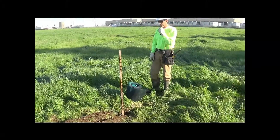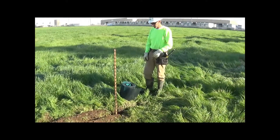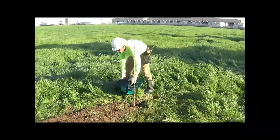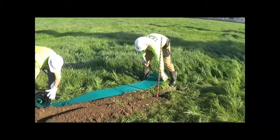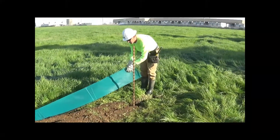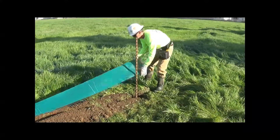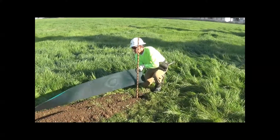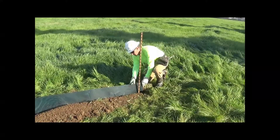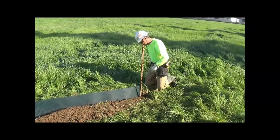For this part of the installation, we're going to install the sediment control barrier at the base of E-Fence. This is Urtec's sediment control barrier, called S-Fence. It's 12 inches in width and comes in 100-foot rolls, and it's made up with E-Fence. You can see the sediment control filter is the light green, and then it has that heavy backing — the substrate polymatrix material.